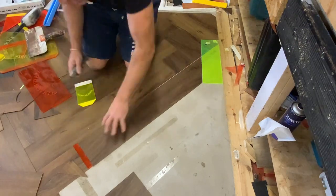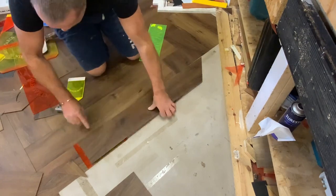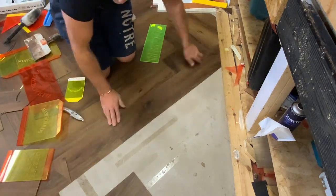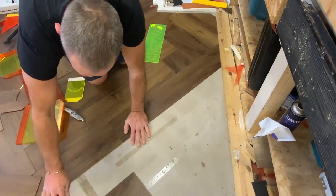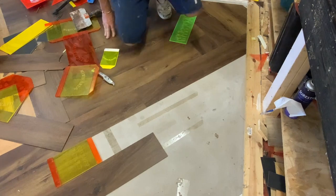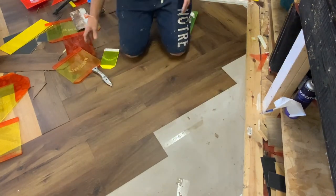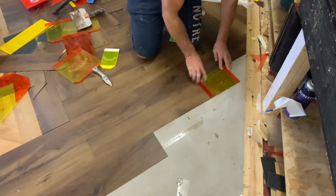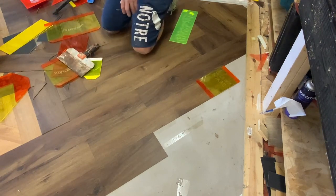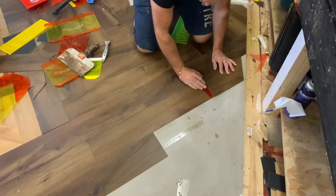Then just mark your boards - I've already got them up there but I'm just showing you again. Just drag the knife up here. Sometimes I like using the longer board so you can support the plank all the way across. Once you've got that mark, when you go to the next cut, for the rest of the cuts along that wall that you'll be cutting in, if you line each cut up to the mark that you've made on your board instead of just where it's going to be, you're going to get all of those ones in first time.